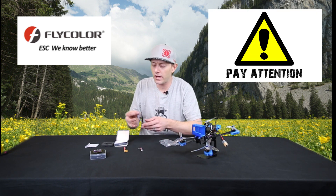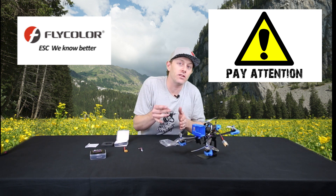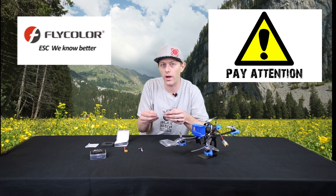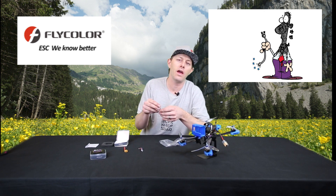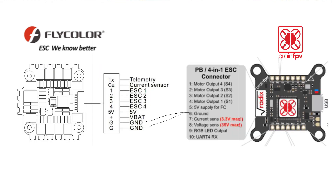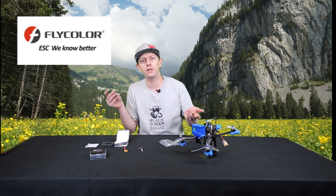Now be careful — do not just plug the ESC in and then plug it into whatever flight controller. You have to make sure the pin map is correct. If you plug it in wrong and you don't check, you can fry your flight controller and you'd be very upset. So always double check the mapping of the wires before you plug it into your flight controller. It wasn't too bad — there are some pins here where you can use a small tweezers or razor blade, pop the pins up, pull them out, and put them back in. It's not ideal but it works pretty well. Just be very gentle on those pins and make sure they snap back in properly — you don't want them coming loose while you're flying.